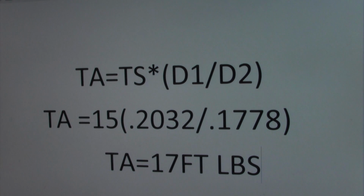And that meets the requirements of those of you that really wanted to get detailed. Thanks for watching this video. Hopefully this helps you in an easy way to calibrate and just make sure that your torque wrench isn't broken or flawed. Obviously, as you saw when I did the math on that, I was actually applying 17 foot-pounds of torque versus the 15 that I had hung from the end of the wrench. I hope that's useful to you.